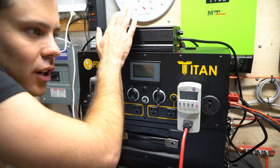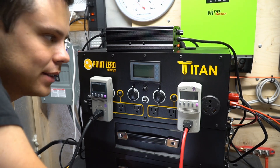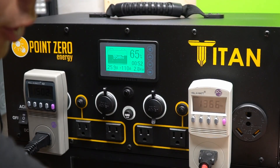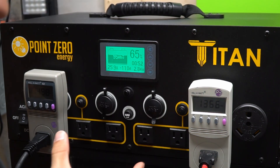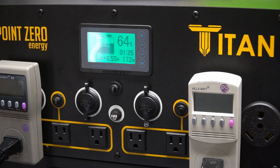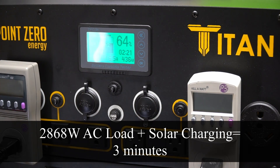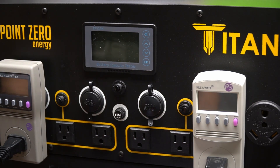Let's let it cool down, turn off the AC chargers, and we'll run the inverter at maximum capacity. Now we are repeating the same test but charging from solar only, not from the AC chargers, and the Titan has been able to cool down a bit. The inverter turned off at three minutes again. It does not like maximum discharge while charging — whether it's solar or AC chargers.